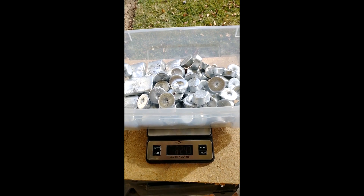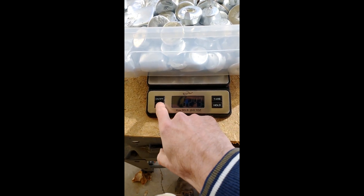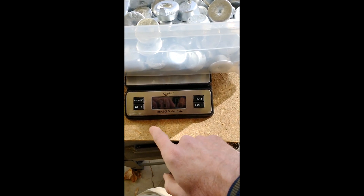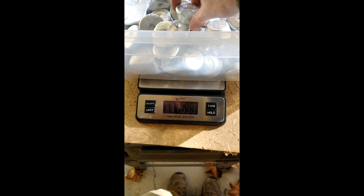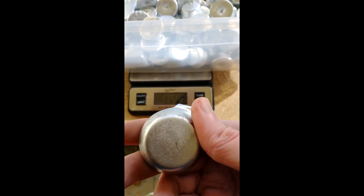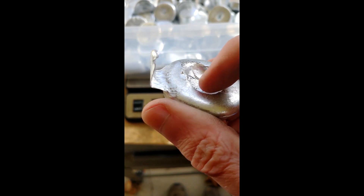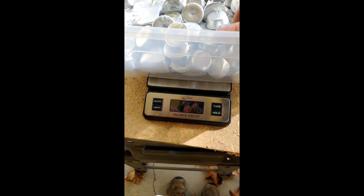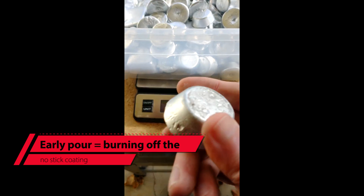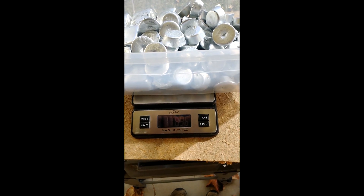Not something I could do one-handed here, but we came in at 624.3 ounces, or just over 39 pounds, or 17.7 kilograms. One of the things I do like about this metal is how clean it actually pulled out, but again that is a nasty divot on the shrinking aspect of it afterwards. Something I'll have to keep in mind as I use this, but it was extremely clean — no bubbles or anything else on that one. That's not the case on all of them, as you can see here. Some of this was probably the early on pours, but it does have a lot of promise, minus the major shrinkage.